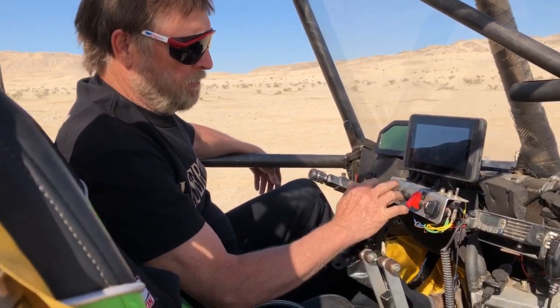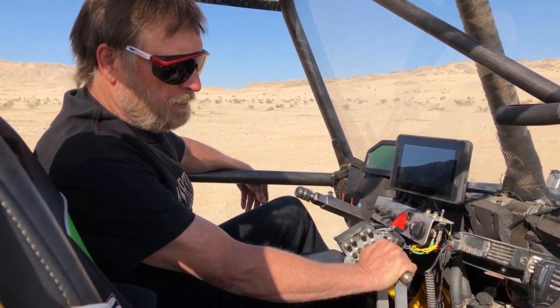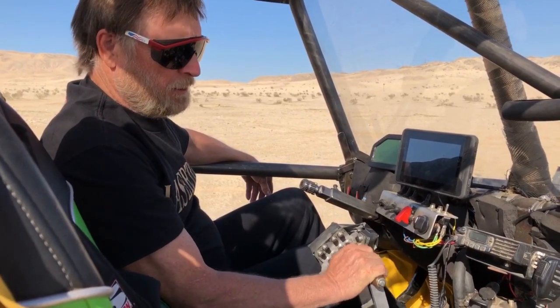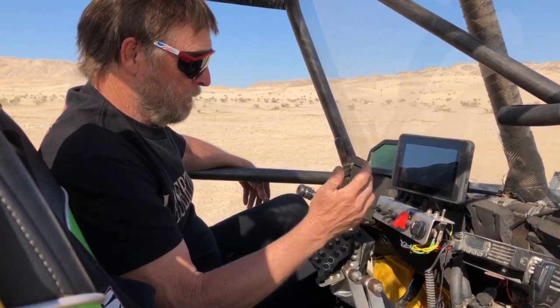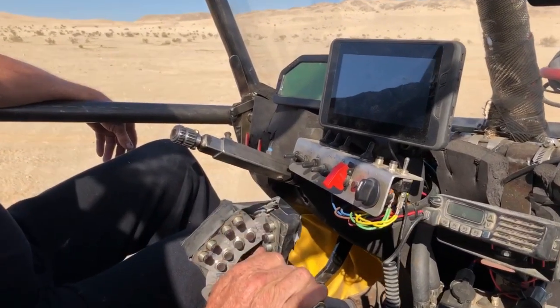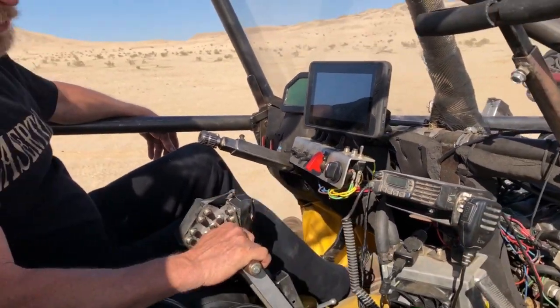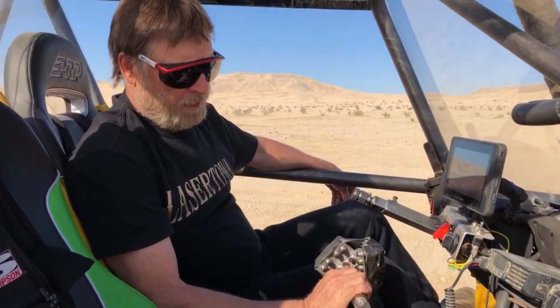And that will let this foot do another task, because now as I put power in, I need more power, so I'm stepping down on the gas to get the power and letting off. It's just kind of a balance that I'm doing now to drive the car, simply because I don't have a governor on it. But I can see in the future a governor being the ticket to running this car, with just a rheostat, and your speed controlled with the hydrostat totally, like a skid steer or any other hydrostat vehicle.